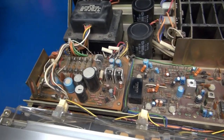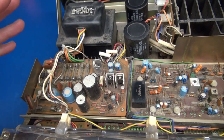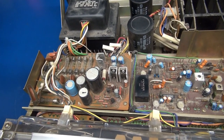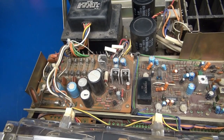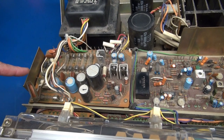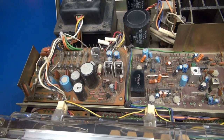To give you a little history: when it came in, these two fuses were blown and taped to the top of the receiver. You might think, well maybe I can just pop in some fuses and flip her on — I think not. We should verify this power supply and make sure we don't have anything shorted before we attempt power-on. So let's do that.